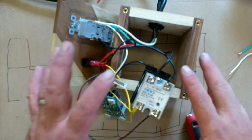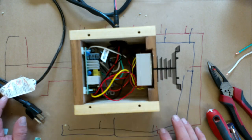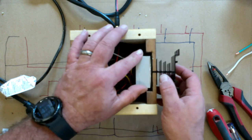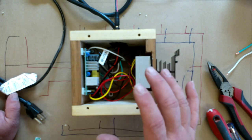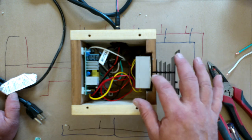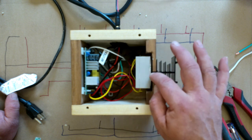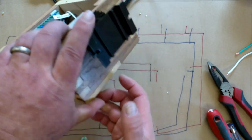So now I've just got to shove all this in the box and screw the box together. Here is everything placed into the box. The solid state relay — the one I'll put a link to — came with this heat sink. I ran for a year and a half with a solid state relay just like this one that did not have a heat sink. It was recommended to put a heat sink over 10 amps. So I went ahead and thinned out the wall here so that the heat doesn't get trapped in the box. The heat off of this relay is going to be dissipated through here, and this will be outside the box to keep everything nice and cool in there.